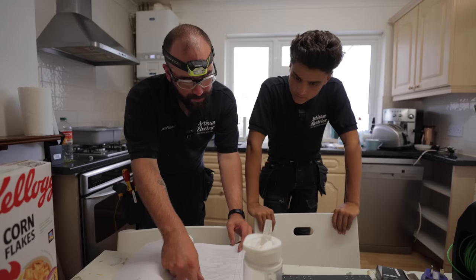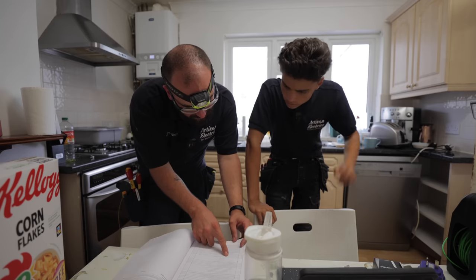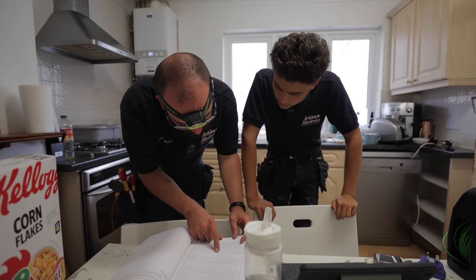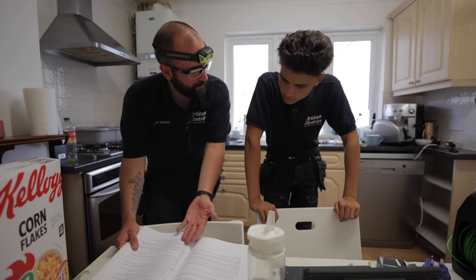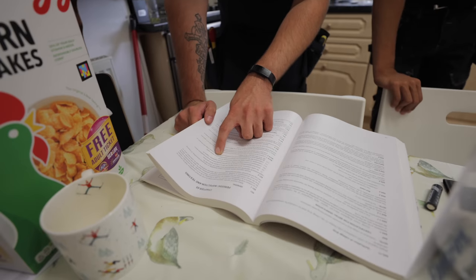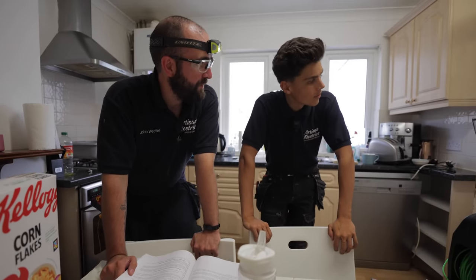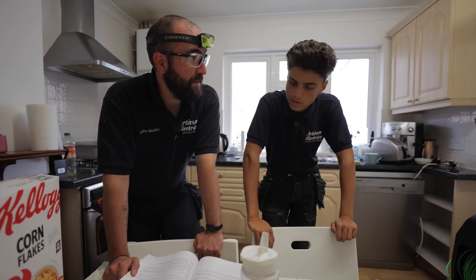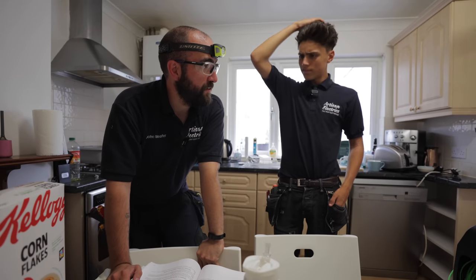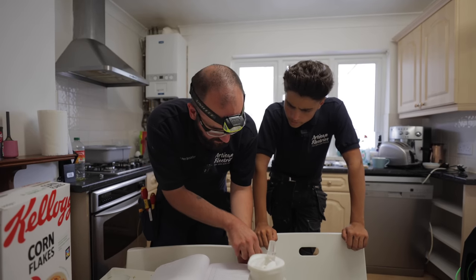So we're on section five, final circuits. So we go down to 5.18, condition of accessories, including socket outlets, switches and junction boxes. So 6.51.2, which my finger was on already. Note V, so 5. Confirmation that the installation is not damaged or deteriorated to impair safety. So would you say that socket over there with the melted terminal is damaged to impair safety? Yeah, probably. Because burning isn't good. It's melted a bit, and now the shutters that go into it aren't functioning as they should do. So it can potentially expose the live parts. Right. So we'll put down a C2 on there under that banner.